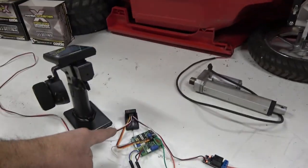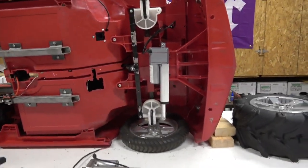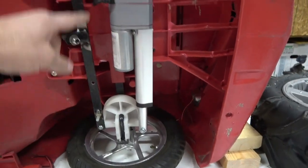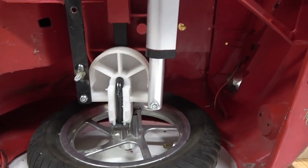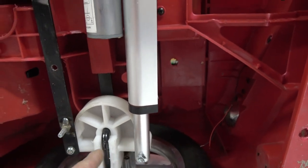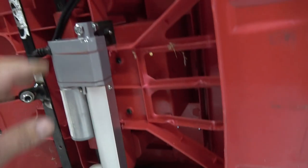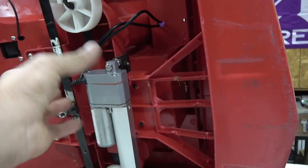Other than that it's pretty basic. The hardest part is going to be how to mount your linear actuator. It's basically a push rod, and you have your tie rod that connects the two steering spindles — you want it to be in a straight line. The easiest system is to drill into the front of the spindle. If it doesn't have a two-sided mount you might have to bolt on a rod to make it like a spindle arm, like on a go-kart.